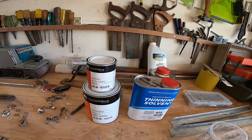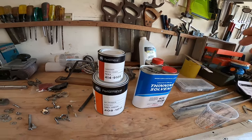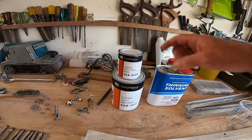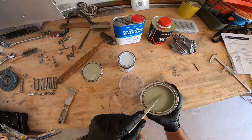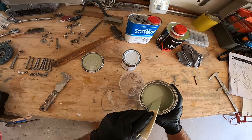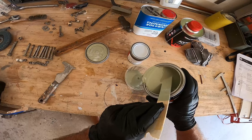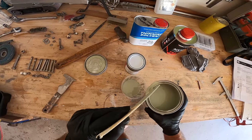This is a zinc phosphate epoxy, so it requires its own particular solvent because I'm going to be rolling and brushing it. It's mixed on a 4-to-1 basis. So let's get underway — ratio of 4 to 1. I started with 100ml in there, pouring very slowly.